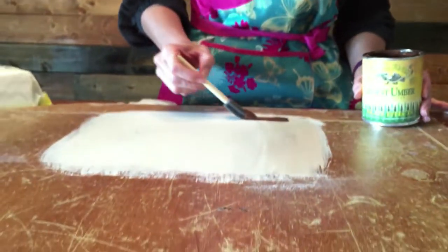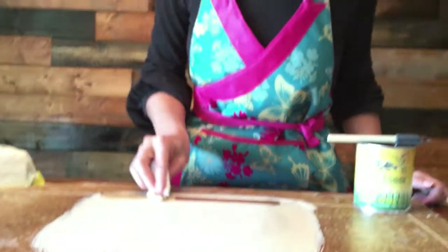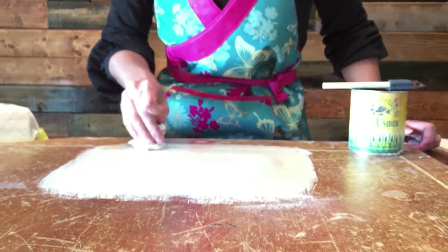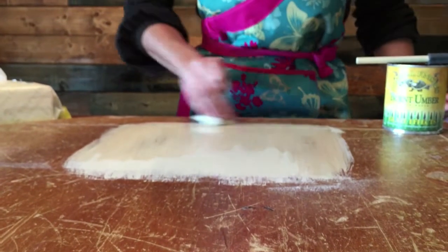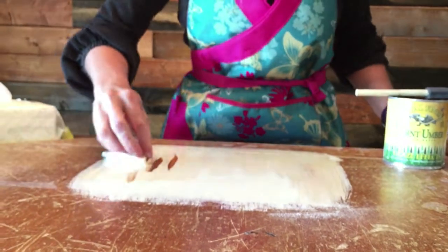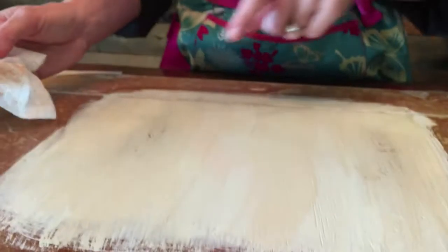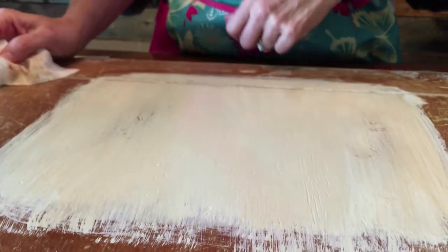I want that dark to show up inside and along edges — tables tend to get more wear so I try to put the glaze where wear would be most. Once I've got it to the level I want, I go with the grain because I want the glaze to look like part of it. I use baby wipes to blend it in. You can see it really nicely picked up that wood color, with a little glaze color over the top giving it that antique look. Then you just let it dry.